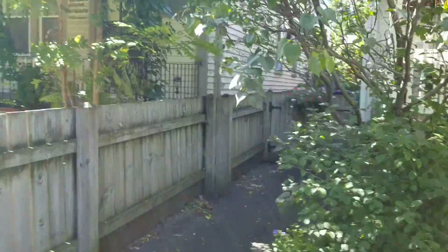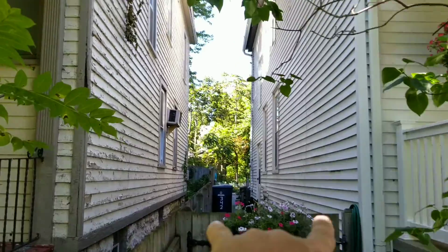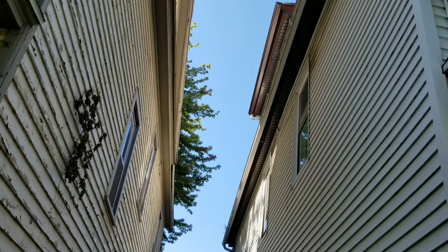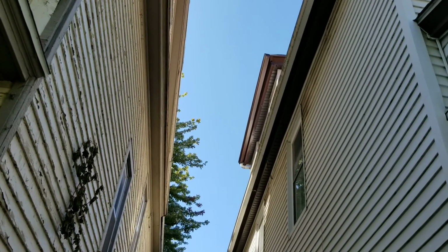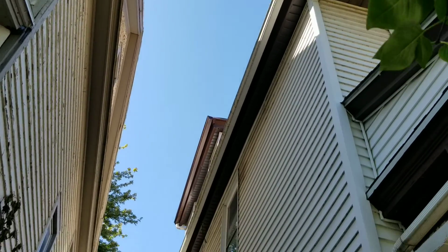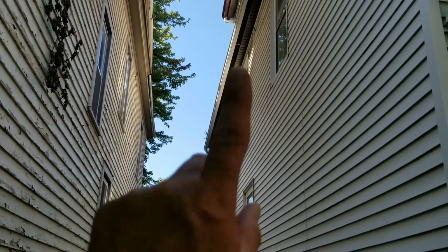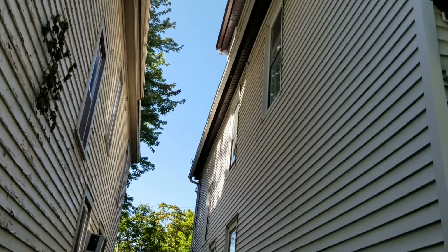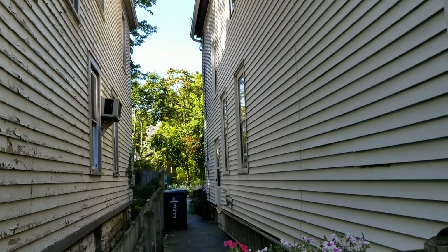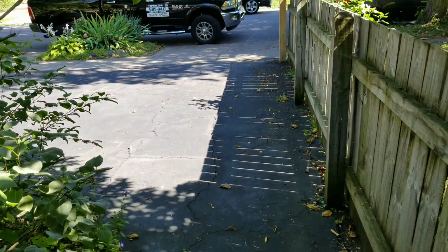Here's the other side of the house. We've got a good probably 4.5-5 feet, so they should be able to run their masonry scaffold all the way up here. But we have the same issue as far as our top gutter. We're gonna have to rebuild that fascia where that brown gutter is at the top. And we can strap hang what we got here. Looks like they got a gutter garden growing out of the gutters over there on the far side. Actually, they got a gutter garden growing in the middle of the gutter too, so this gutter is doing no good. But this side here, we could conceivably put a boom lift here